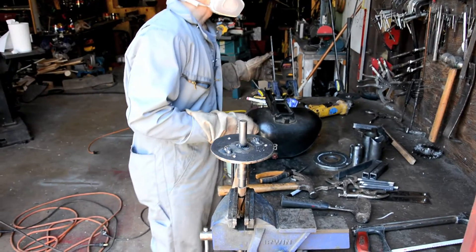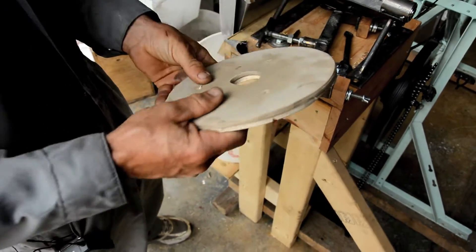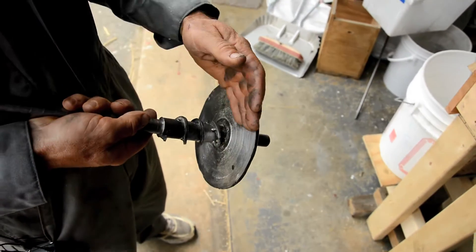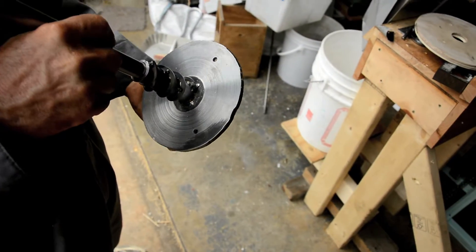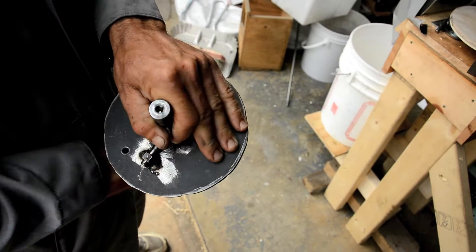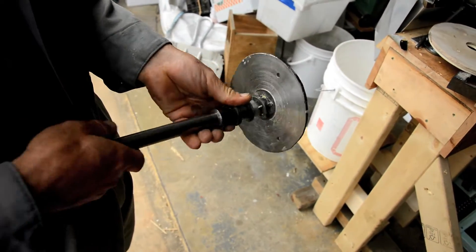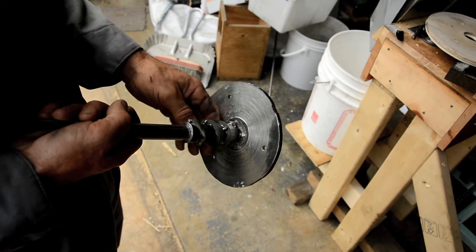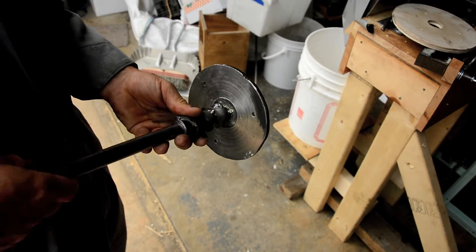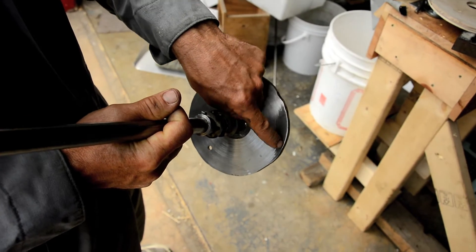You can always chase the hole with a drill bit to straighten it out a little bit, but you actually want it to be pretty tight. Once you mount the runner plate on the shaft, because of inevitable distortion in the welding, the face of the plate will not be square to the shaft. So I took it to a machinist and asked them to face-turn it — mounted the shaft in the lathe, centered it, drilled the other end to support it properly, and then turned it. It takes about 45 minutes, so you'll be billed for an hour of shop time. I asked the machinist to leave a little bit of the plate with the mill scale finish just for educational purposes. The machinist faced the plate square to the shaft, and this was the lowest spot on the plate.